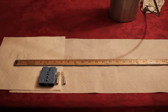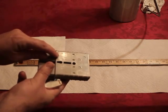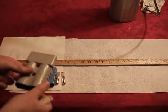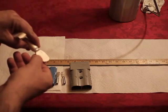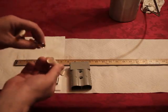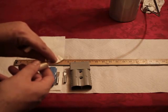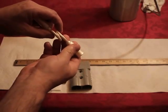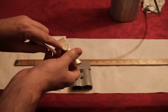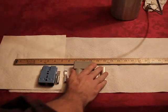As a comparison, I went ahead and ordered a 350 amp Anderson style connector — maybe a genuine Anderson, for all I can tell. It says right on it 350 amps, less than 50 volts. Look at the size difference and the construction difference. Same general design, but this one tells you the cable size is 2/0, which is two-aught — a lot bigger than 2 gauge. In fact, this is so big I can put the whole thing inside it. More importantly, look at the machining: the contact area is done so that when it's together you're getting contact all the way across the front, allowing it to carry more amps — contact in a line on both of them. So if this is 350 amps, how is that other one 500 amps?